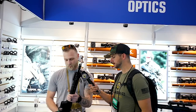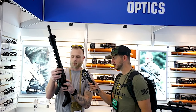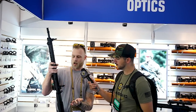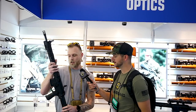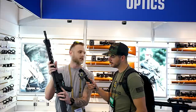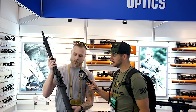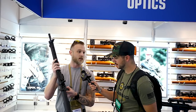One thing I really like is we were able to shave down the weight so it is actually lighter than a mil-spec forging without sacrificing integrity — pretty unheard of for billet. Starting at the upper: the charging handle has an easy grip, it's angled in, and you have your forward assist moved forward, which is good for ambidextrous charging handles and left-handed shooters. Also, we're not utilizing any roll pins — they're all set screws, from the safety selector to the forward assist to the rear detent.